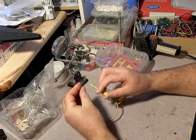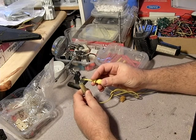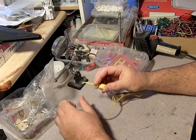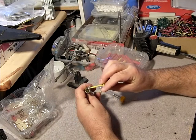If I plug this in without a resistor, what's going to happen is it'll light up for a second — and you may have just seen a spark — and this is dead already. Sometimes they smoke, sometimes they pop, but this is now a useless piece of plastic.